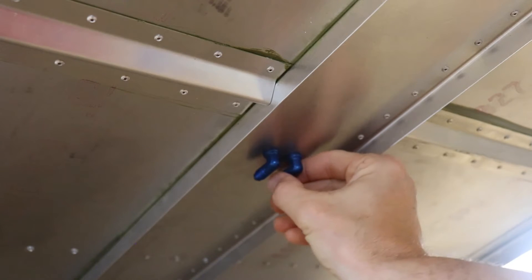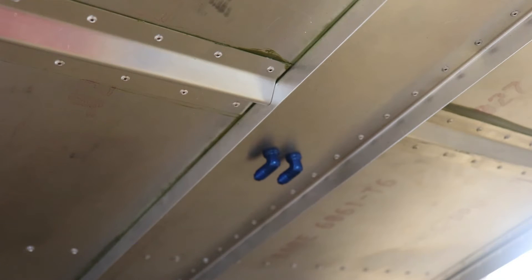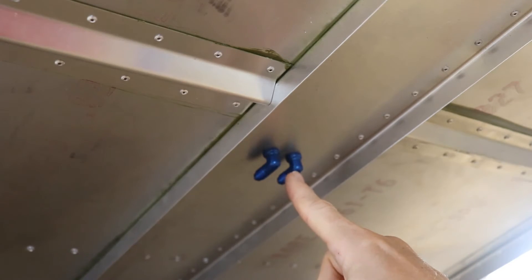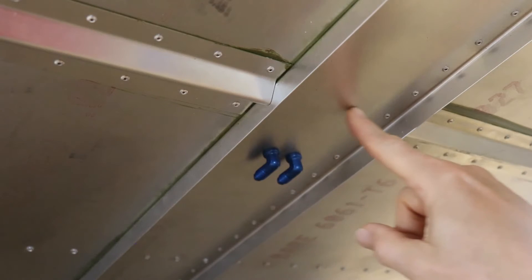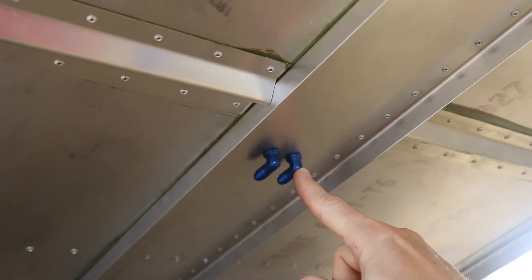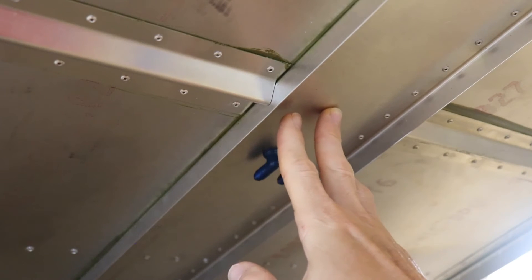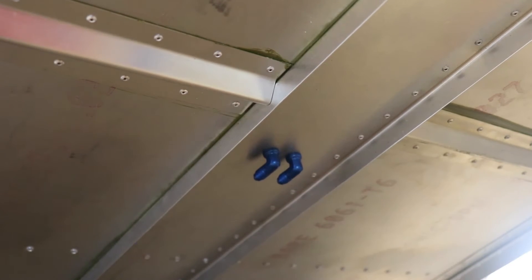We're now under the bottom of the airplane and you can see the bulkhead fittings — they face aft. Both will have brake lines going back to the landing gear and down to the brake calipers. They're positioned here — behind these two stiffeners on the bottom of the fuselage — on purpose. I'm going to order another stiffener from Zenith, cut it to fit inside this channel, which will offer protection to these bulkhead fittings. If you land off-airport and get tall grass scraping the fuselage, it'll ride off this little ramp and bypass your fittings.